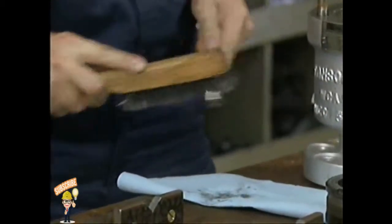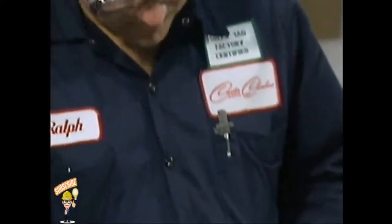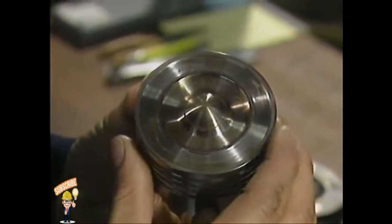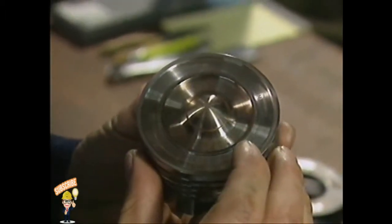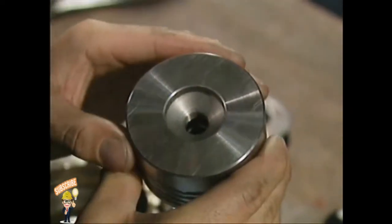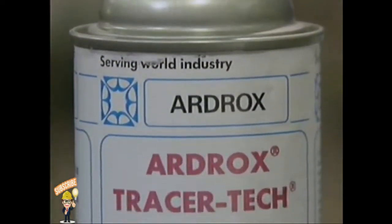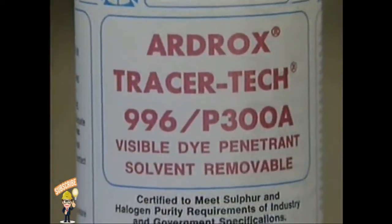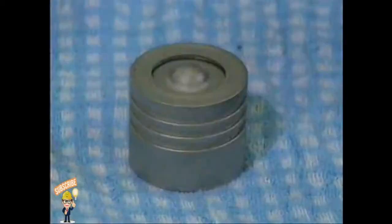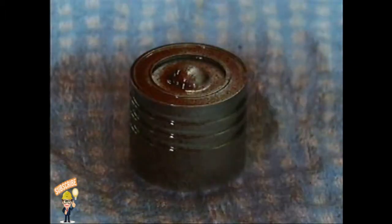Finally, follow your facility's procedures or the valve manufacturer's recommendations to clean all the disassembled parts. Check the disc carefully for cracks — even the smallest crack can rapidly become large enough to allow a valve to leak, and a cracked disc must be replaced. Dye penetrant testing is one way to locate surface cracks and flaws. First clean the disc, then apply the dye penetrant oil, which is a mixture of light penetrating oil and dye.